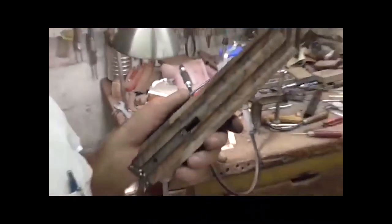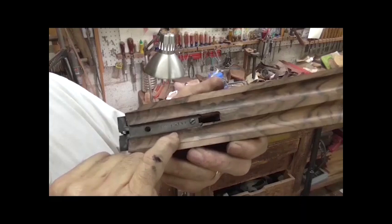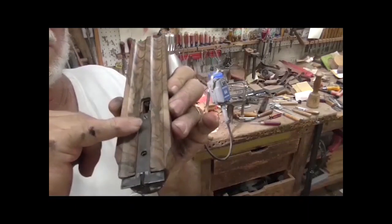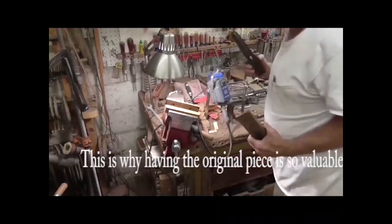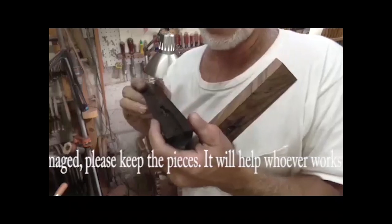Something's rocking. I'm pushing down on the front, and the back comes up. There's something rocking in there because of where the fulcrum is that it's rocking on. There's a pretty good smudge right there where my fingernail is. Actually on both sides. Where this little ridge is sticking up, I think I need to flatten that. Could be rocking right there on those two little high spots. And on the original one, those are kind of flattened off right in here. So that may be it.